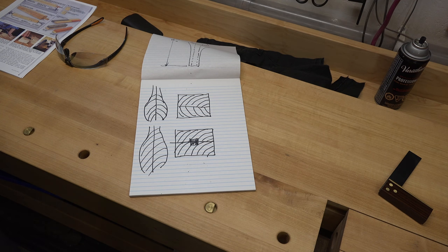The whole spread or footprint of this leg is nine and three-eighths inches from the inside edge where the dovetail ends to the outside edge, and I'd like to have nine inches in height. I'm going to mark my nine inches across. With that, the section of the leg that makes contact with our pedestal is going to be three inches in height, so at six inches from the bottom we're going to put another mark.